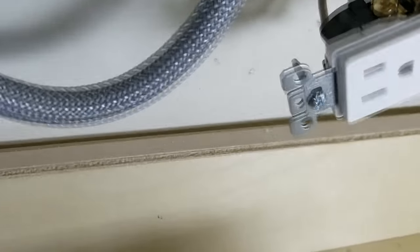The red wire is pinched and held in place by the plate, and now I insert the black wire as well. The black wire is tightened in — all I have to do is connect the ground back to its Wago nut and the switch will be fully wired up. Now I'm tucking that unused white wire way back in there out of the way. In keeping with my method, I use electrical tape and wrap the terminals so that nobody could ever get shocked even if they stuck their hand or a tool in there. There we go — the outlet is nicely wrapped and safe for anybody to touch it.